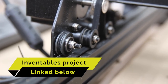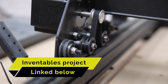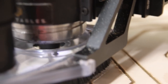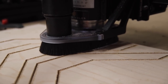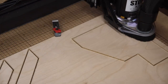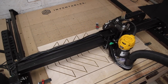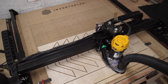I'm using regular birch plywood, about three-quarters of an inch thick, 28 inches wide and 20 inches in length — 28 by 20 by three-quarters. I'm cutting a couple of arms — these are actually the support brackets — cutting four of those, and I'll glue two and two to make them a bit thicker. Then I'm cutting the bracket itself to hold the arm and will glue those two pieces together.